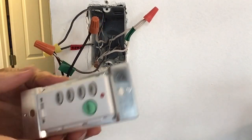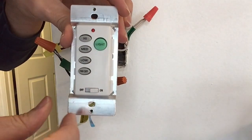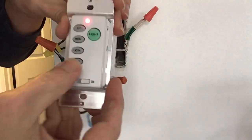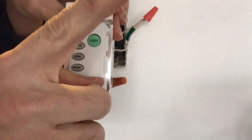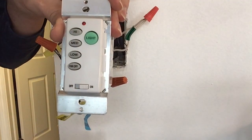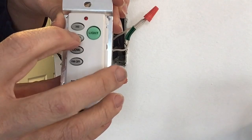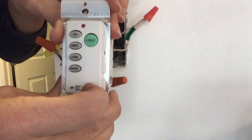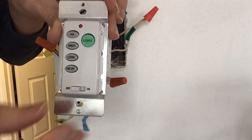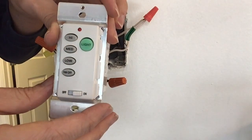These remotes also ask you to wire the middle green wire to your ground, so in all three boxes the copper ground is wired in as well. Another thing to know: you have to make sure the current has a complete circuit through all the sources. Remember, when you turn the light off and the fan off, you're actually cutting power up the line — though it must still be going through because you can still turn the light on. I'll turn the fan on high, then medium. But if you switch any of these switches off, the circuit is not complete and none of the remotes will work, including the handheld remote I got for $20.